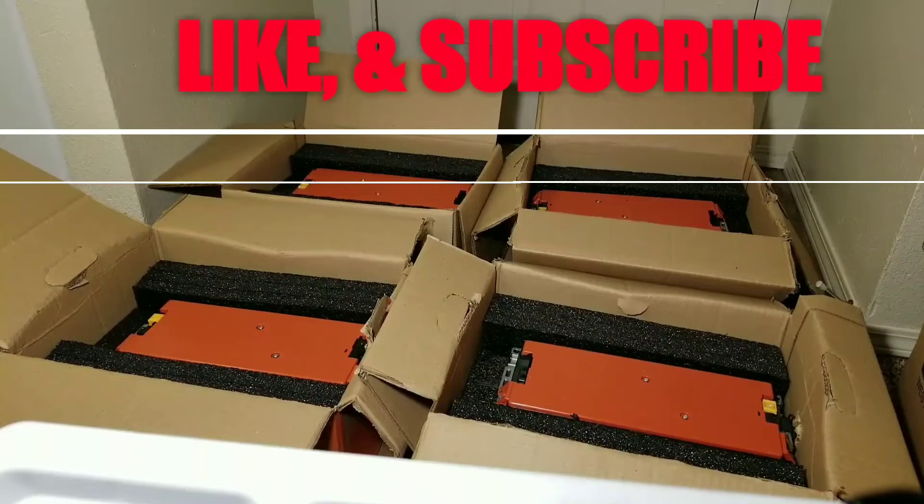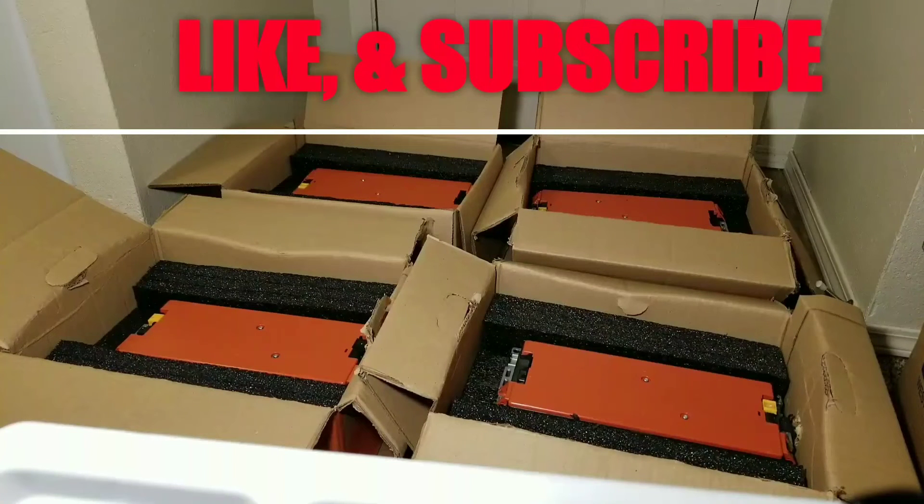About the module size: the length is 14 inches, the width is 6 inches, the height is 4 inches, and the weight is 21.5 pounds — not heavy at all. It's well packaged and thin. Since they are 12-volt modules, you can do a 48-volt configuration at 75 amp hours rated — tested at 72 — or a 12 to 24-volt configuration.